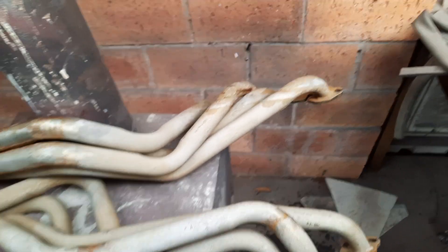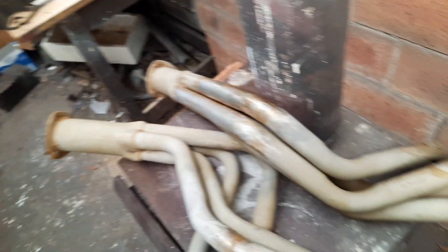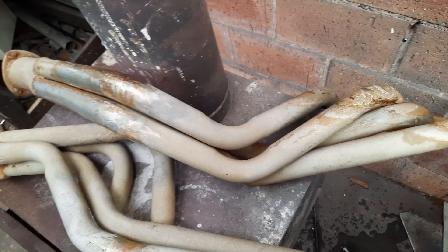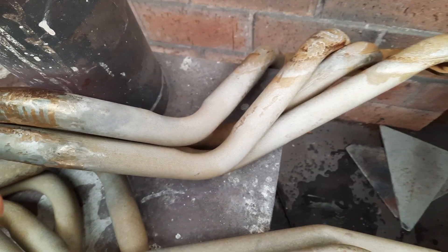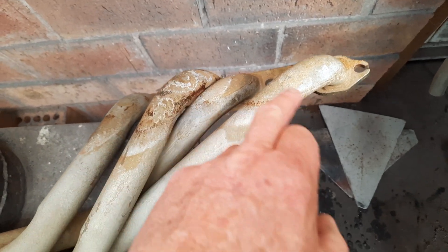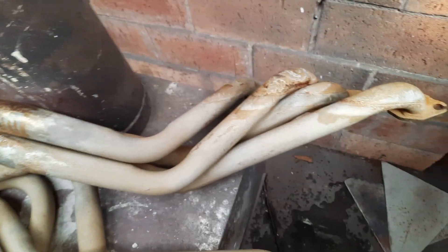You can see where it was sticking out there — there must be a little hole in the plastic, a pinhole or something that I missed, because the acid level did drop a bit and it exposed the top just here and up here. That's why we've got a bit more rust reappearing up there.